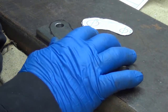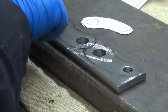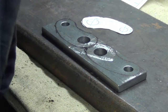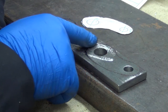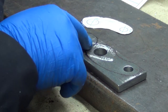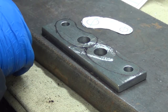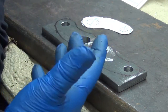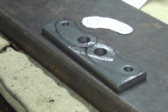When I measured off the inch and a half, I should have come over to the other end, because it was positioned like this when I drilled it. I started here and came this way — I probably should have gone the other direction, come in at 5-6-2, and then moved to here. What I've ended up doing is putting exactly an inch and a half here, but now I don't have enough width left for a bandsaw cut, so there's going to be a little flat spot there. It's prototyping — I don't need it to be pretty. But if it came out pretty enough, I'd make another one to match and have one set done.